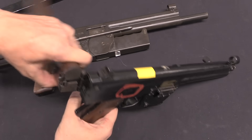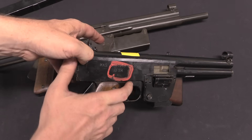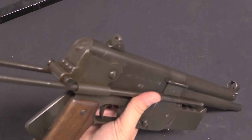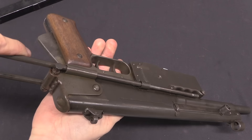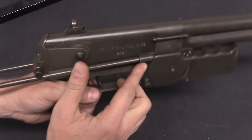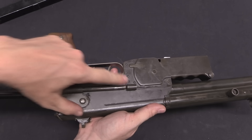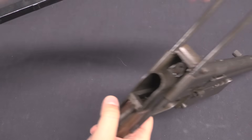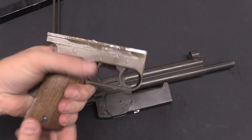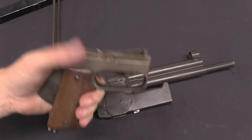On the Model 1948s, the takedown system is pretty cool — the grip assembly also acts as the rear retention. All I have to do is push in this little button and I can pull out the rear grip frame. What they did on the .45 ACP version is really cool and clever. You can see this is the end cap, and it's got a big rivet on either side. The way this one works is: we extend the stock to the fully extended position, push the button and pull it just a little farther back — that's as far as the stock can extend. It's now free of these front retention tubes, and it just folds up and opens the gun. I can pull out the rear trigger frame. Note that MAS has clearly taken a lot of inspiration from the MAS 38, which had a very similar style of grip frame that comes out self-contained with the fire control parts.